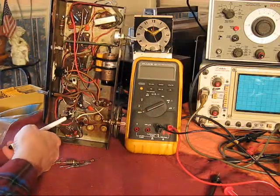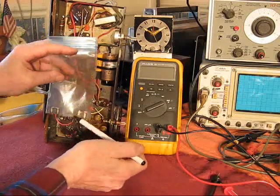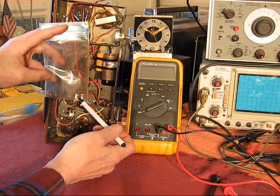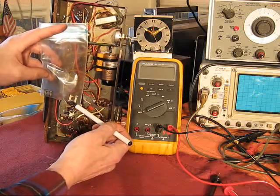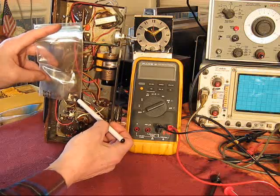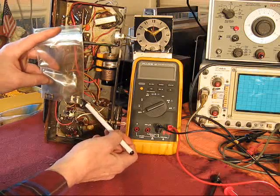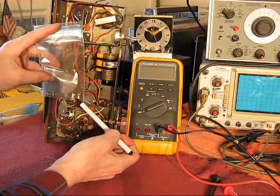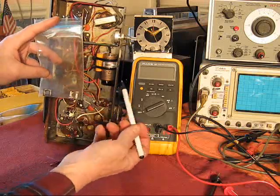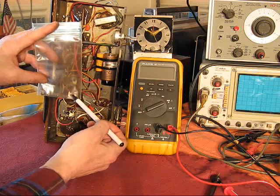So I decided to go ahead and restore this can, and being the replacement, it was different. You can see the relative size of these two wafers, and what difference I noticed with this replacement can is that the two capacitors are further separated from one another, so that would be much less likely to leak across this gap between the two. The trouble seemed to be that while there was no leakage between these two capacitors, the connection to them was flaky. And I've heard, and understand, that this thing called silver disease is usually associated with leakage paths. This one wasn't so much like that as just intermittent connection inside this.